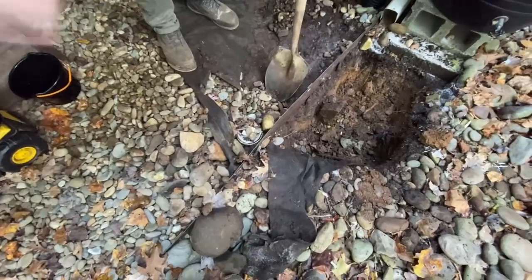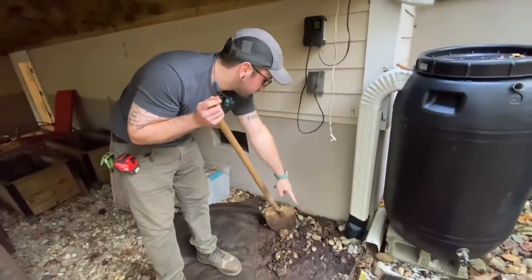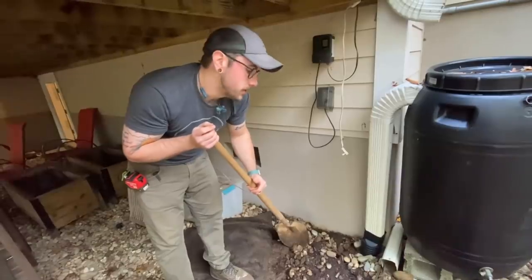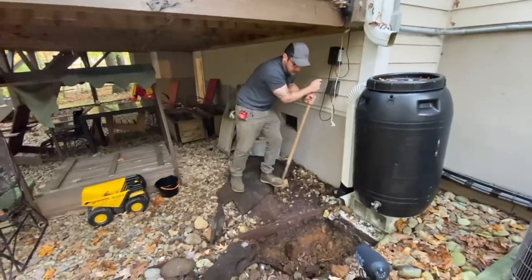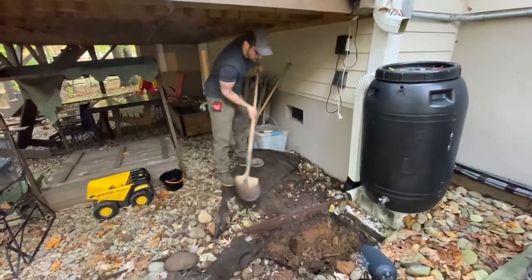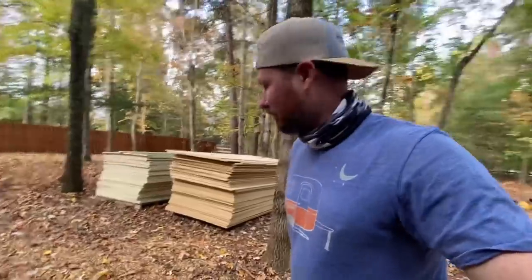There's the clean out — that's the sewer, so that goes over there. We're looking for where the sewer connects. The PEX on the inside goes underground right under here. What I'd say about the PEX is it's probably two feet down, because otherwise it'll freeze — that's code. He reviews everything; I'm a hard critic. That's what happens when you actually have to pay for stuff.